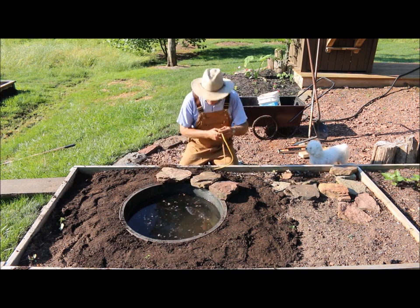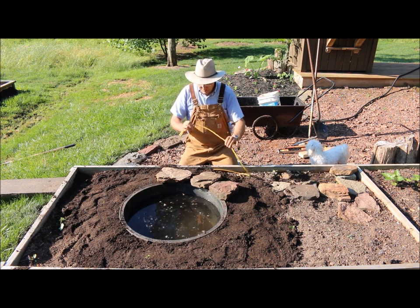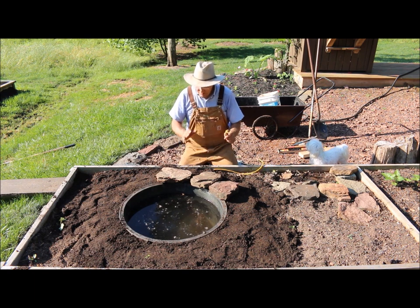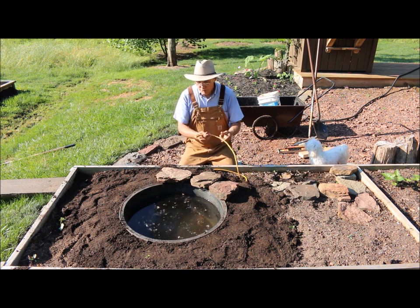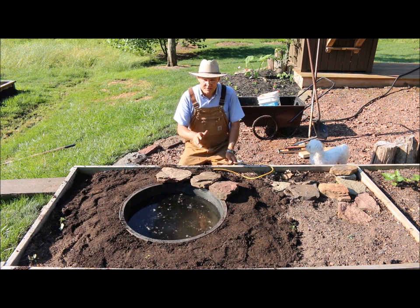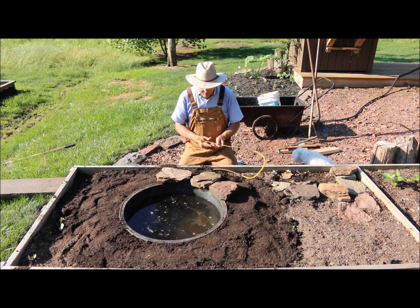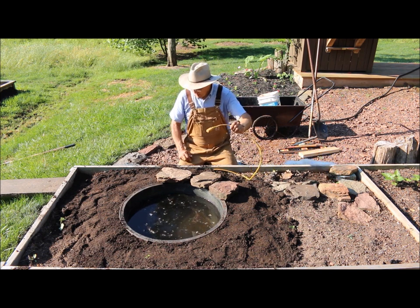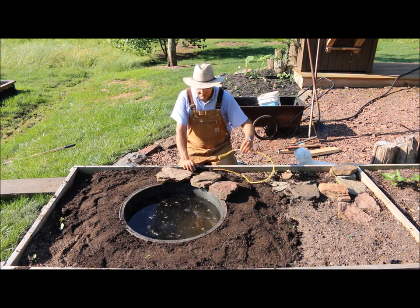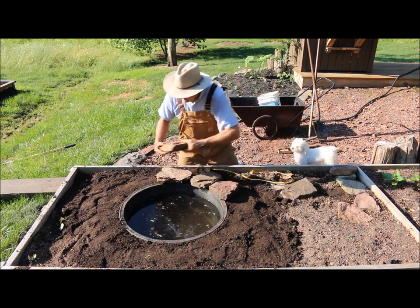Now I also have an extension cord here that I ran over to my fountain area. Obviously you're going to need electric at your fountain, and any type of electrical cord or plug that you put here, you want to make sure it's GFI protected. That's ground fault interrupter. That way it prevents electrical shock. And so you definitely want to make sure any outdoor outlet that you use outside is GFI protected. So I'm going to just start laying these stones in along the edge